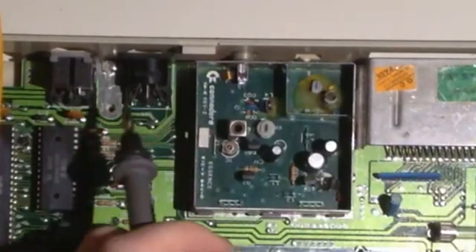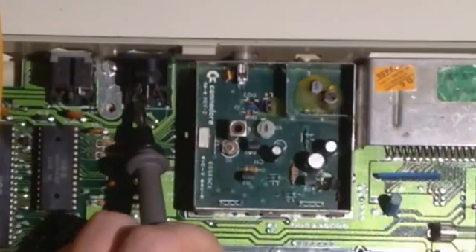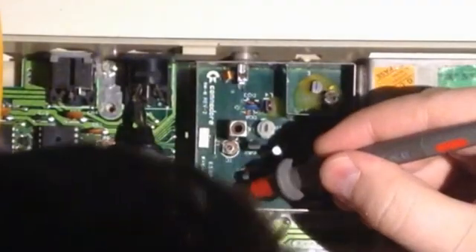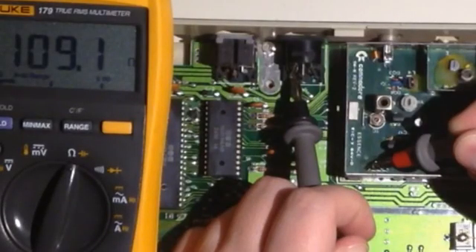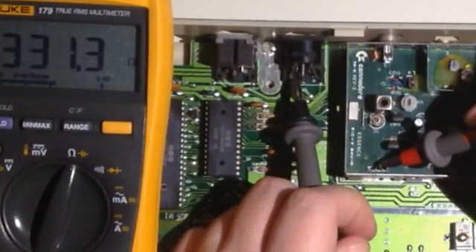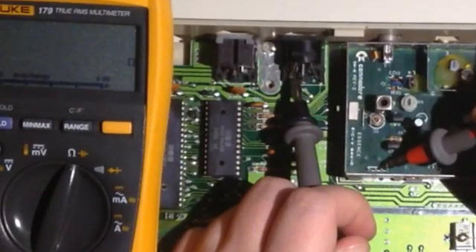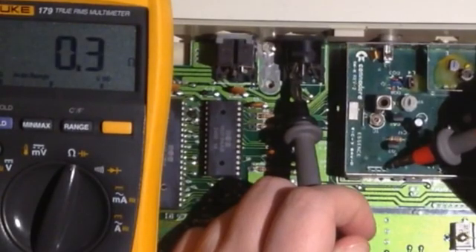What we want to do is find the pin here that has the composite signal. We put the probe on the composite signal down here and search for it. What we want is below one ohm. But it's not this one... no... right, this must be it — this is a dead short. So this is the composite signal.